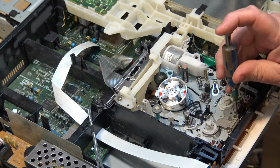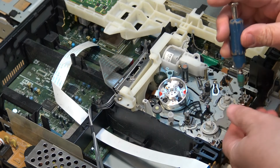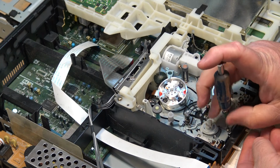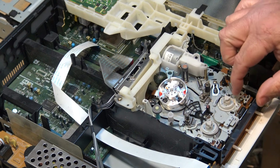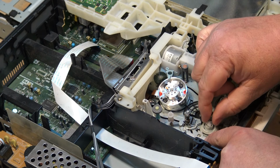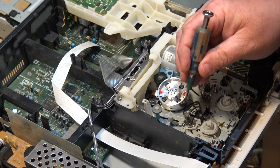So to get at these, I have to take out this little bracket. So lift out those 2 screws. I'll lift out this little bracket. And as you can see the big crack on this, but what I'm interested in is on this side, so I'm just going to release the tension band. I'll just take out this screw here.